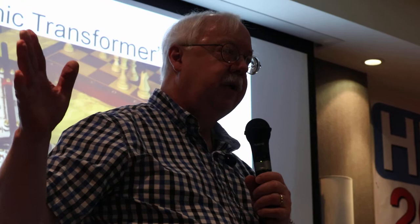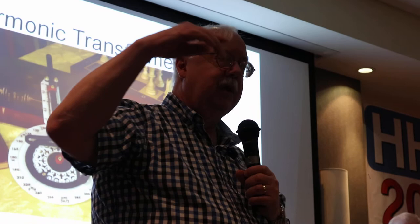There's a device called a harmonic analyzer — there's a whole book written about it. It's a big mechanical contraption with essentially 30 gears, each of which can represent a sine function. There's a spring coming off each lever driven by each adjustable cam, and it adds up the terms implicit by your orientation of the wheel.